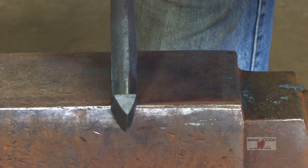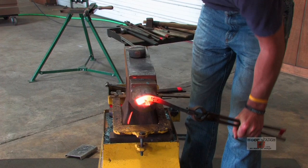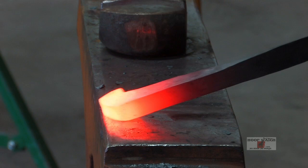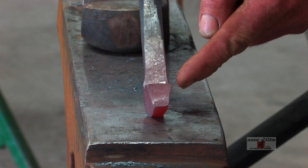You'd want to have half your shoe done as far as run through the block. So you make your heel in one and press it through the block, rasp it up and get it pretty close to having a nice tapered cut on it. You can finish that taper, if you were to fit it, by bringing it back to where the burn was. I've mushroomed this out in the front to start getting the width. You can see I've got plenty of height. You can see I push out the sides. That's where I need all that meat to lock into the edge of the block.